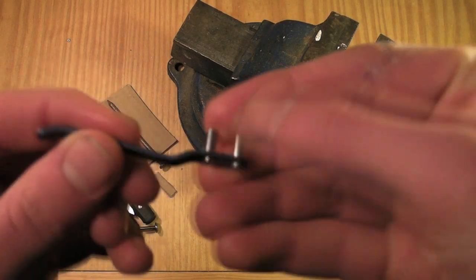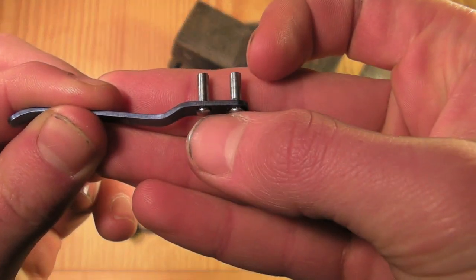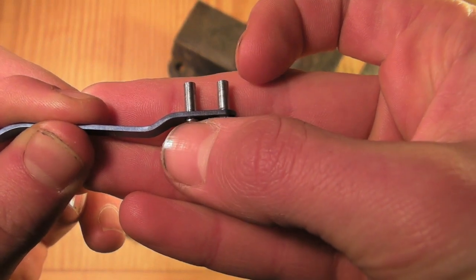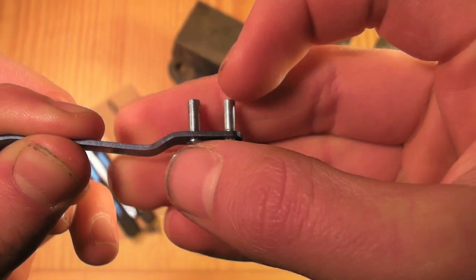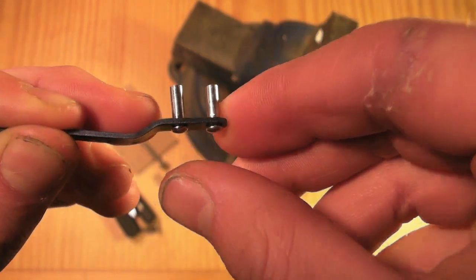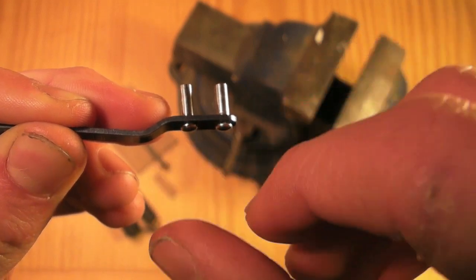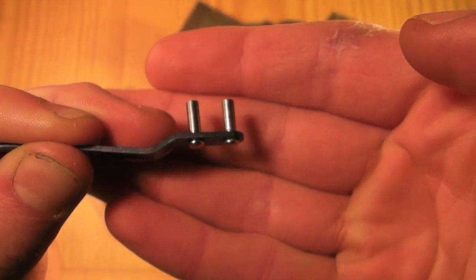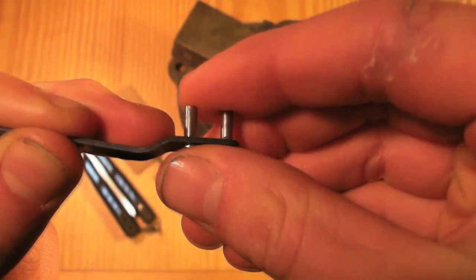And basically what press fit means is there's little ridges all on the ends of these pins here, along the whole diameter of the pin, right at the head there. And they're forced really hard into that pocket clip, and those ridges make a wedge and keep it in there with a great amount of force, and you're going to need a lot of pressure to remove those pins.